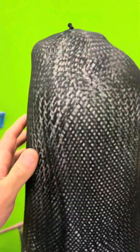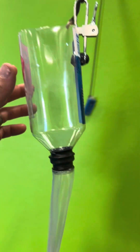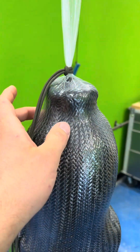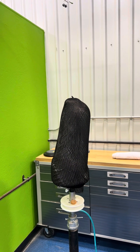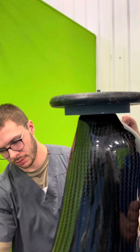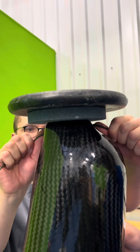Part seven of how they make my prosthetic legs - this is going to be the final part before you guys actually see me walk in them. This is the carbon fiber in a woven blanket with what's like a pantyhose over top of it. That creates a wick for this system - also a plastic bag over all the layers - to get the epoxy to go deep down inside so they can get rid of all the air pockets and voids. That makes it incredibly lightweight and ridiculously durable so they can last 500 miles. They square off the top and put a weight on it - that's the platform for the pyramid adapter to bolt to.